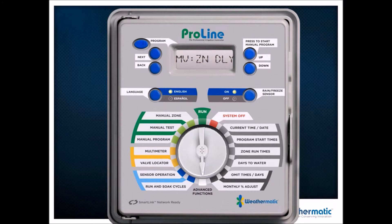Master valves — this is mostly about pump start relays. Pump start relays use more electrical power, so if I try to start my pump start relay and my master valve and my zone valves simultaneously, my controller will short out or cause it to skip a circuit. We're able to isolate those skip circuits so the master valve comes on and gets up and running so we don't get hit with that inrush current, and then we turn on the other valves. Another reason to do master valve first is to pressure that zone — when I cut that valve on, I've got instant pressure and it doesn't have to fill the main line.